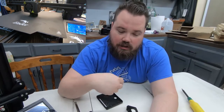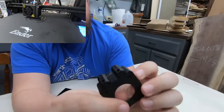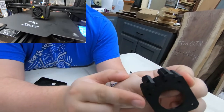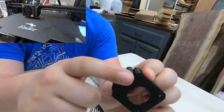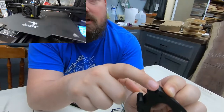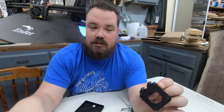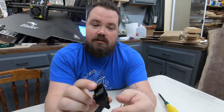As we go through the next three prints, I kind of dialed it in to where we ended up with really good first layers. The second one still had just a little bit of elephant's foot, but only on one side. I got one side dialed in really well, and then went back and lowered that side of the bed just a little bit for the next one.